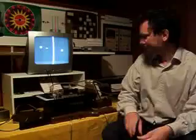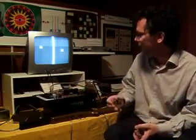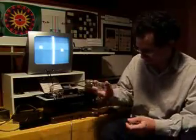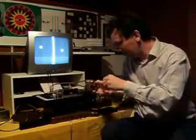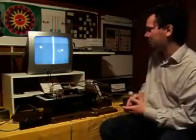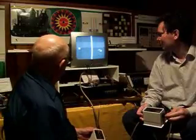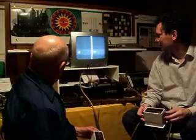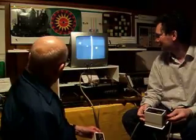So let me show you how this works. Here we have an Odyssey game and I can remove the ball generator — so we just have the two paddles and the central line. Here is the original square ball generator, and here is the updated one, which is larger because it uses more components. If I plug the new one into the Odyssey, you will be lucky enough to see a nice round ball appear on the screen. Here we are playing the original Odyssey with the round ball generator. David and I will demonstrate our fantastic ability to volley back and forth at a speed roughly equivalent to a turtle walking across a road.